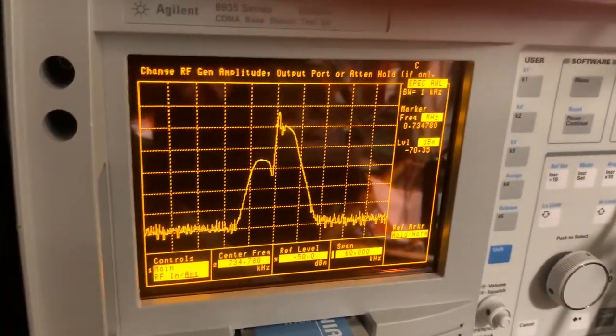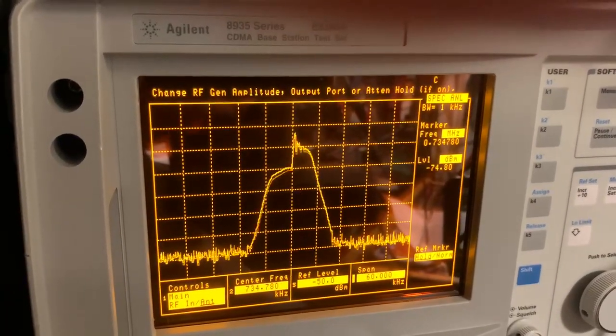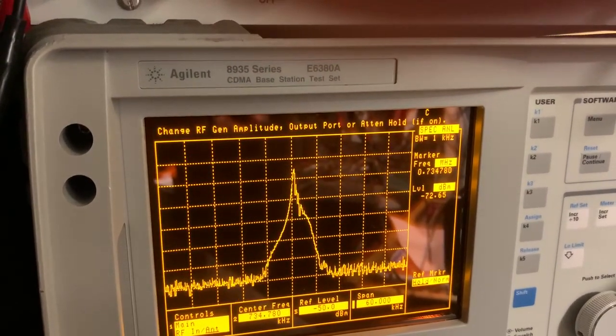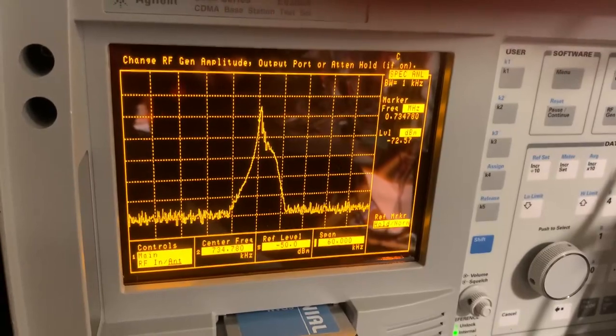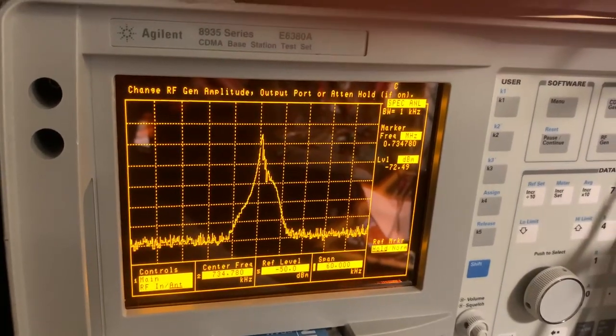Switch to the next steepest response curve, and again I can change the response with the crystal phasing control. Get much more of a steep peak if I just want a peak of the curve there, which is great for CW reception in noisy conditions where you've got adjacent channel interference. You can get rid of that.